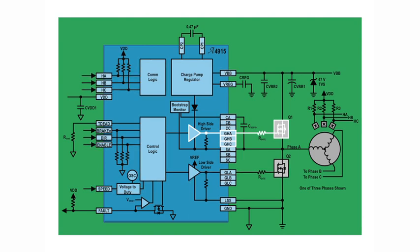The driver implements center-aligned PWM which automatically recirculates power in the bridge between the high side and low side MOSFETs. This feature distributes power dissipation between the external high side and low side MOSFETs, improving thermal management and reducing noise.